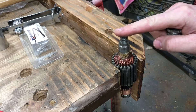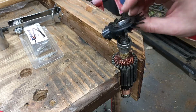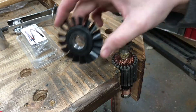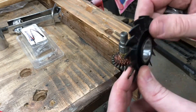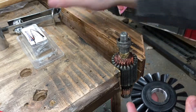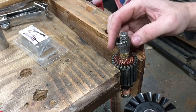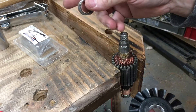I have my router armature held tightly here in my vise. When the old fan got shredded, what was left behind was just this center part — this is obviously a new one that I ordered — and as you can see it's got this little metal bushing on the inside. That was a pain to get off. I used these little cheap pulley pullers and just tried hammering on it. Ultimately I just turned to my Dremel, cut it in half, then used the pullers again and it came right off.